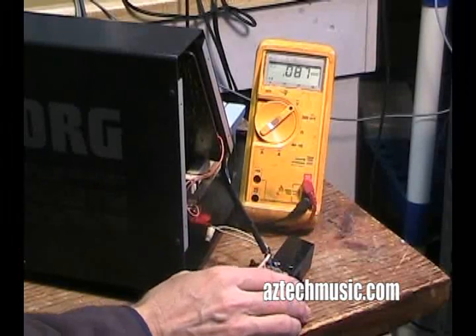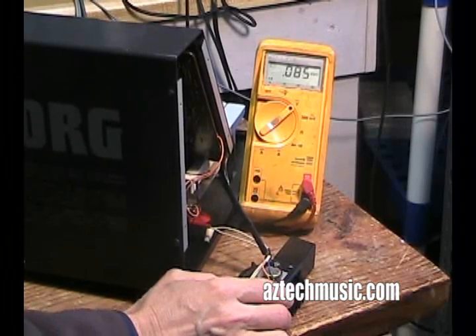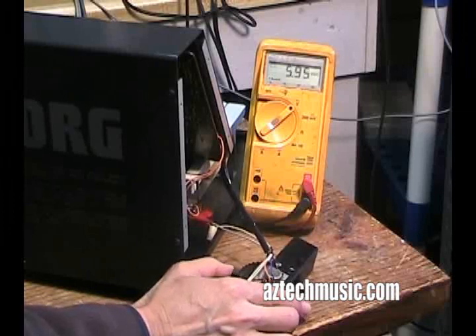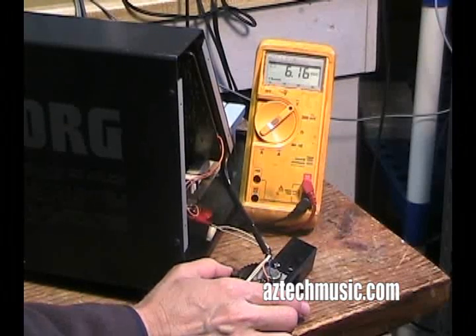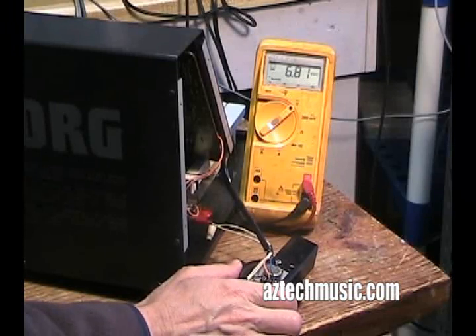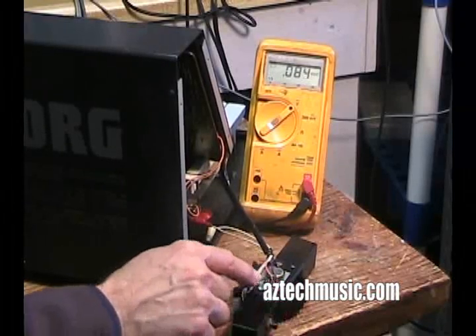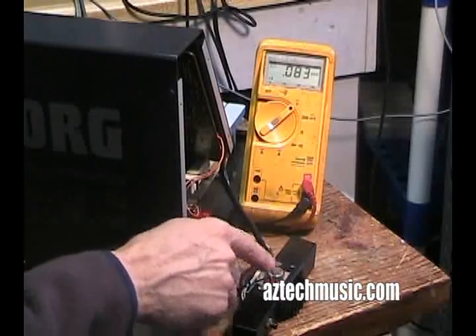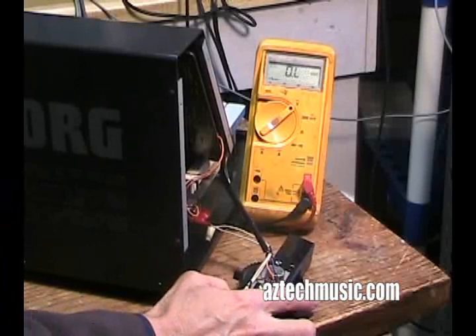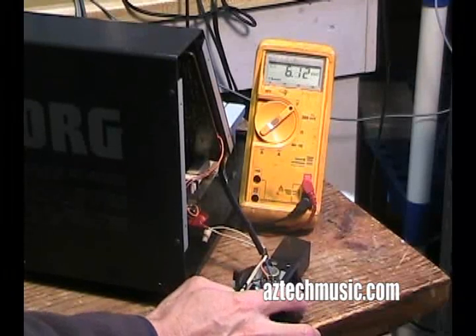As you look at the voltmeter, you can see it's starting to swing — that's about center on this unit on this pitch bend. It's about 0.08 volts, so that's pretty close to zero. I'm sure this thing has drifted a little over the years, but 0.08 is not bad. As we swing to one side of the pot, there's your 6 volts DC, and we go to the other side of the pot, you can see it swing to the negative rail, which is negative 6 volts. Then we go to center on the pitch bend and you're back at zero volts. You actually have your voltages on each side of this pot, and the center is going to be your variable that you get out. That tells me that this unit is working right now, and we can proceed to hook it up and listen to it.